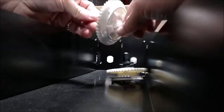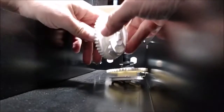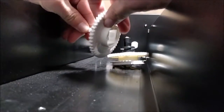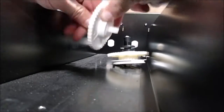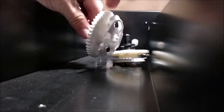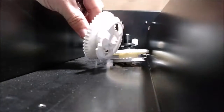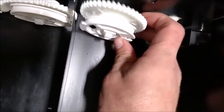To do this, pinch the front and push the shaft out the back — you'll have your retainer and your gear. Then twist or flip the gear like a pancake so that the shoulder is in the front, push the shaft through the hole of the gear, and reassemble. Now the gear shoulder is between the retainer and the gear, rather than having the shoulder to the rear like the first one.